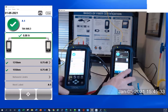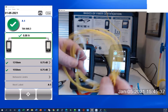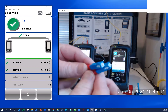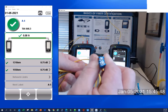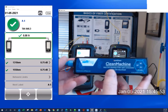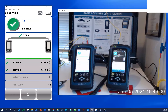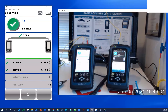So what are we going to need today to perform a two-jumper set reference? We're going to need reference grade test reference cords — four SC to SC cables with 2.5 millimeter ferrules. We're also going to need a cleaning product. This is SoftThing's Clean Machine, our version of the OneClick. There are any number of these available in the marketplace. Depending on how dirty your end faces are, you might also need wet cleaning.